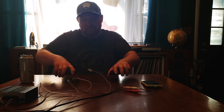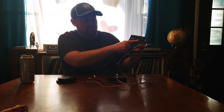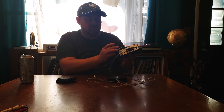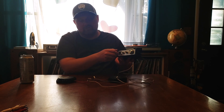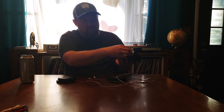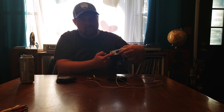We're going to put these in the virtual pinball cabinet. As the ball is bouncing around in the cabinet, we should hopefully get a little bit of that vibration, somewhat simulating the real thing. What I'm using for the amplifier is the Lepai LP-2020A. It's a fairly inexpensive little amplifier with stereo sound and controls for bass and treble. I'm going to turn down the treble so I'm mostly getting bass through the transducers, and it also has volume control and inputs for RCA or 3.5mm jack.